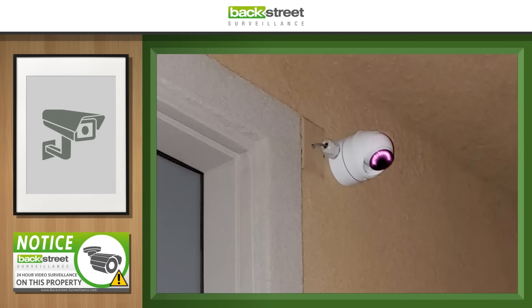They used a single-gang recessed outlet with a blank cover, bringing the cable out the center with a watertight connection into the back plate, then mounted the camera to it. But it seems like a long way to go — you could have drilled the cover hole a little wider, made the connection inside the recessed box, and mounted the camera right over the single-gang cover, eliminating the back box entirely for a cleaner install. Also, the cable is vulnerable right where you can reach and snip it. A lot of effort went in — let's go with a C.